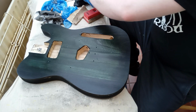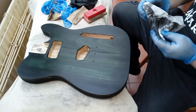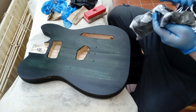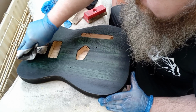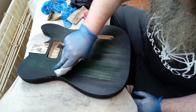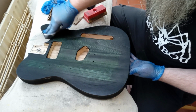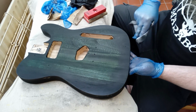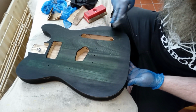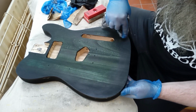Now, put the green one down, because saturated. Now we'll take some of it off with this one. This is dry. I know it looks like that guy from Watchmen, but it's dry. Put a little bit of dark in it will actually help us blend. That's what we want to see. We want to see where the highlighted wood grain is. Nice and uniform. Need some more in here. First coat though, it's already soaking into the wood. Should use this to blend in a little bit, why not? Just do a bit of feathering around here.